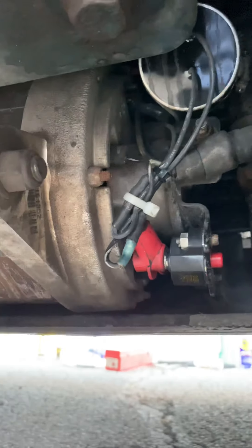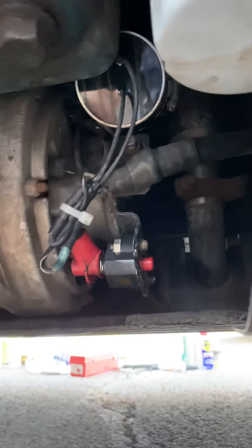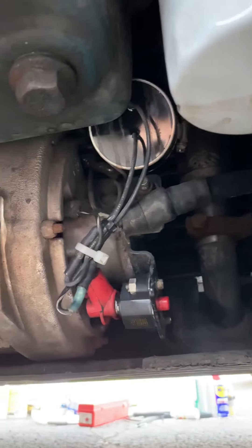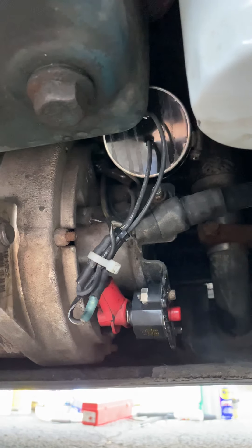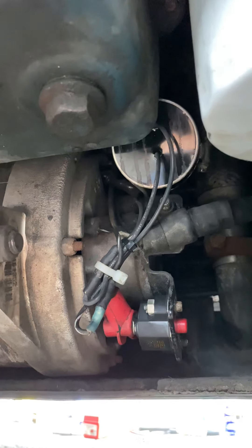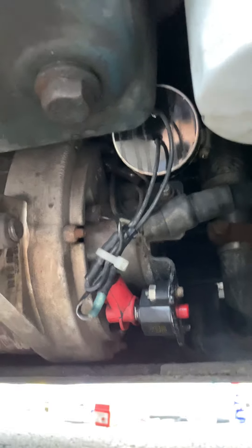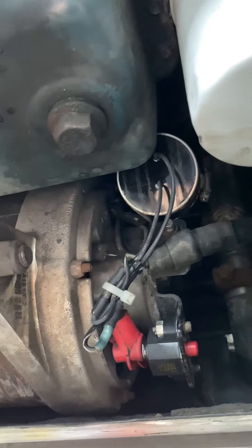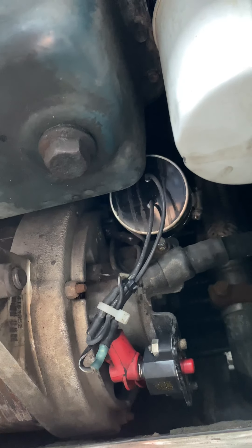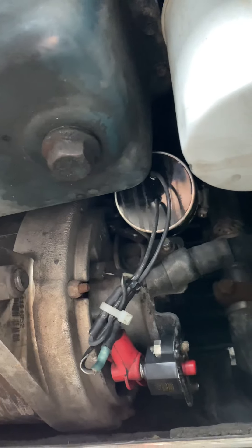The problems can be no power, the breaker can be tripped. So if it's tripped, you have to push the red button in and that automatically gives power back to the unit. But sometimes it doesn't work. Like you guys can see, I replaced my capacitor — it's up there, the new one — because two weeks ago I had power going on and off.